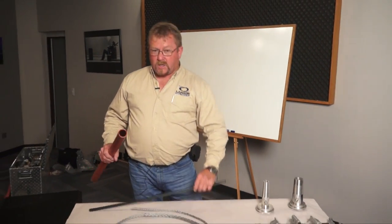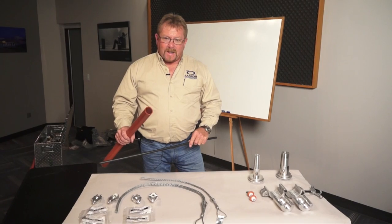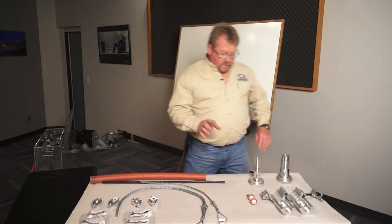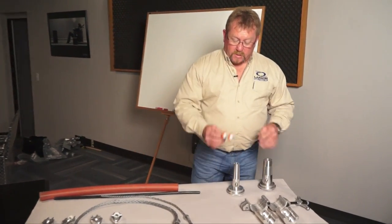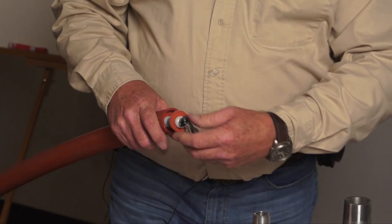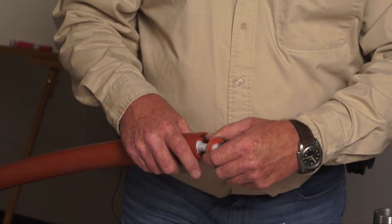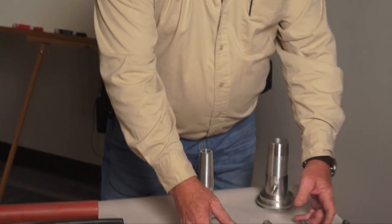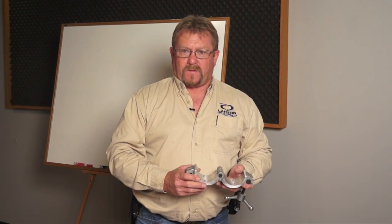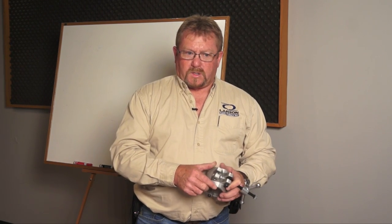So these are the most important things we need to know: outside diameter of the cable and inside diameter of the inner duct. That will tell us which cable pack we need. We also need to have the proper size missile for the inner duct so that when we pick out the right missile and bring it along, we've got that with us too. We also need to connect a short piece of inner duct from the trailer or fiber blowing unit down into the hand hole or cabinet so that we can connect the inner duct to the duct in the pedestal and blow our fiber in.